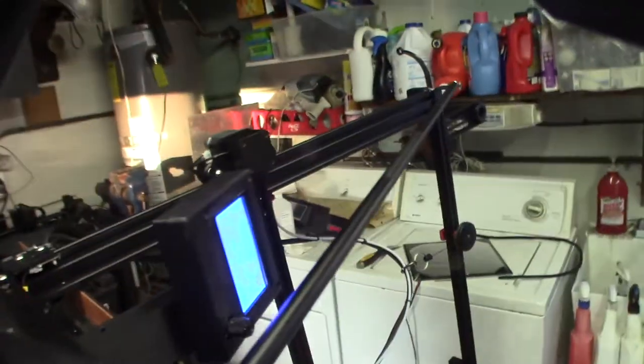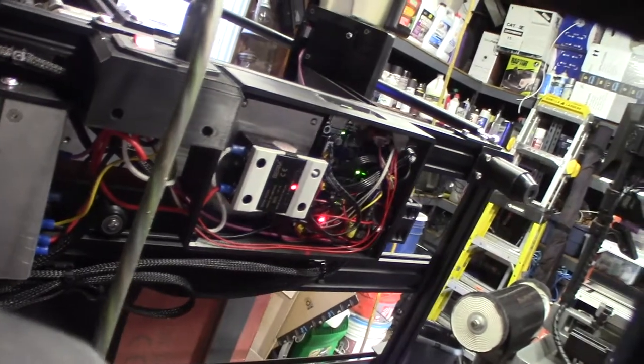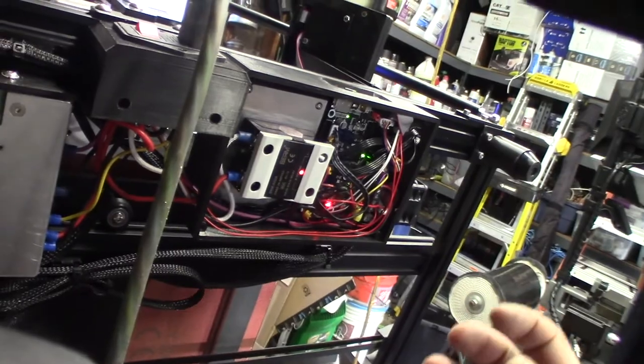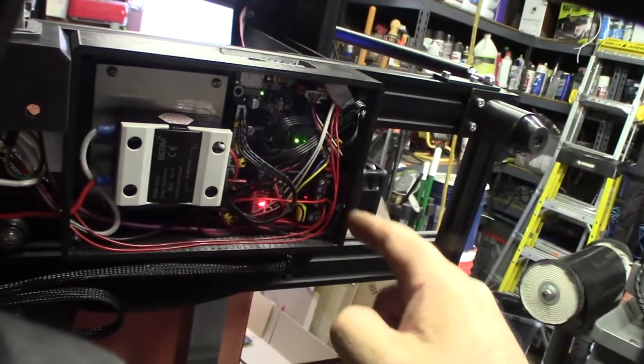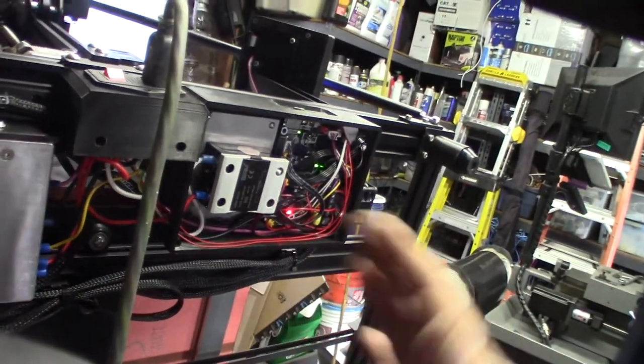Imagine this big 500 by 500 bed running on 12 volts - it took forever. It's up to 70 degrees now - feels warm - verified at 71. The solid state relay is going on and off to keep it at a steady temperature. It measures feedback from the thermistor in Marlin and shuts the MOSFET on and off. The bed MOSFET is basically triggering the solid state relay - a MOSFET is for DC, and a solid state relay is for AC.